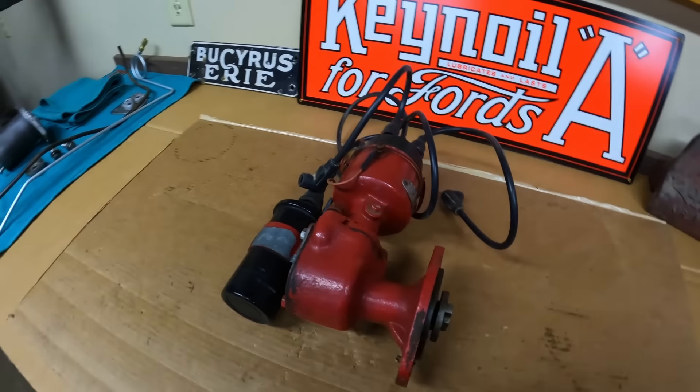I believe it was around 1947 before the IH horizontal distributor drive became very common - I may be incorrect about that, so if I am, post up in the comment section below. That Delco Remy unit is a common field changeover modification that was done to tractors that originally came with magnetos. This being a 1945 model, it's the tail end of World War II production, so chances are pretty good that it had a magneto originally - and that's why we have that vertical aftermarket Delco distributor on it now.